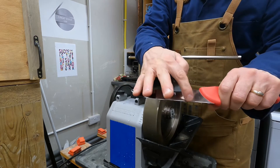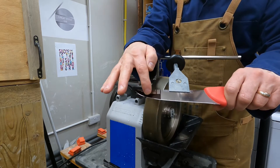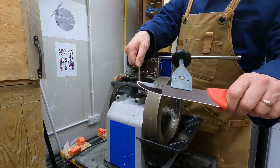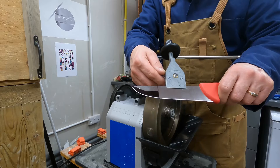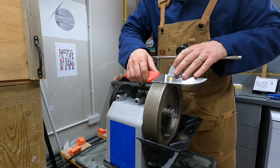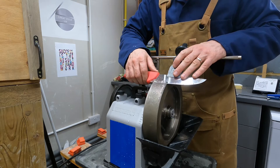If I keep going, the result is going to be an even bevel all the way along up to the point where it starts to switch from pivoting — then at 12, 13, 14 degrees the bevel is going to get wider. It's not going to be very attractive.